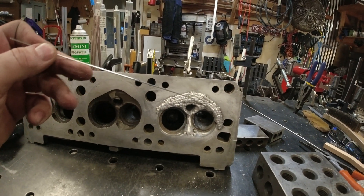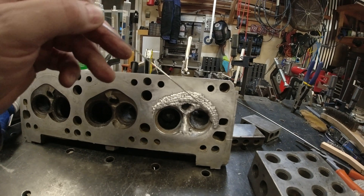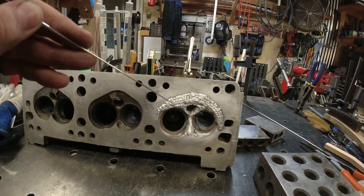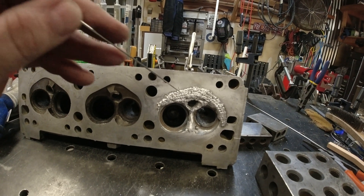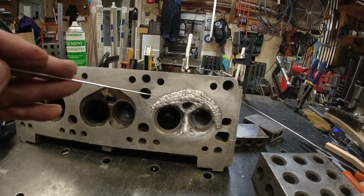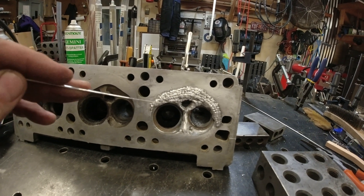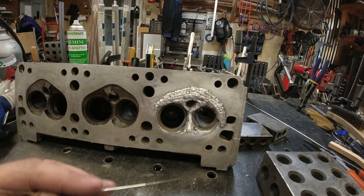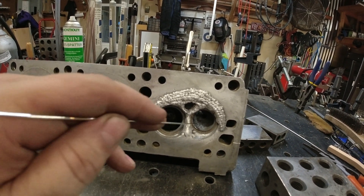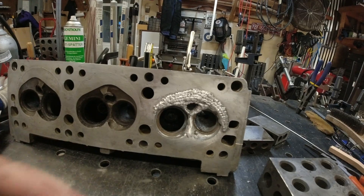So I'm putting a last little pass on here. I sanded it off. The main reason I built it up first and sanded it off was to get to the base metal, because welding to this cast aluminum — it's pure garbage. You're non-stop pulling out crap. So I'm going to work these edges down here, get them all fused in, and build this up a bit more.